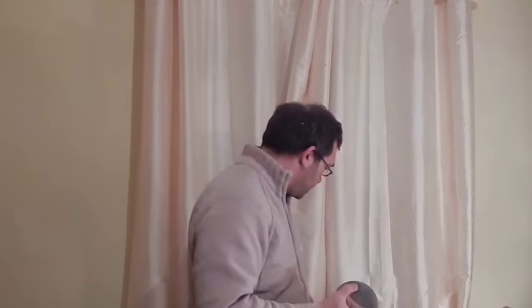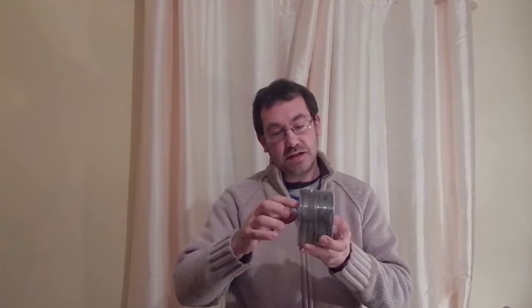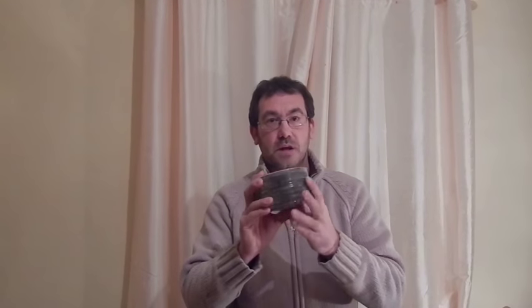And then I'm going to do the same with the second block, and put it onto the bottom. So the whole CD blank will be sandwiched between the two blocks, and also you'll have a nice piece of wood going up through the middle. And then I'm going to turn a goblet out of the whole blank. So wish me luck with that. The whole idea being that once I turn these CDs down and sand them, they'll become transparent and you'll see the spalted wood up through the center, hopefully.